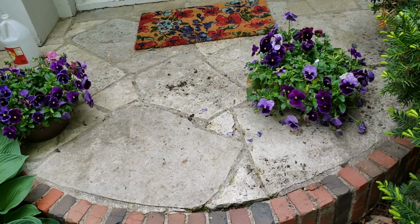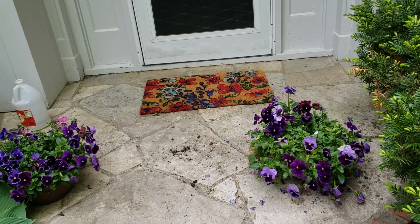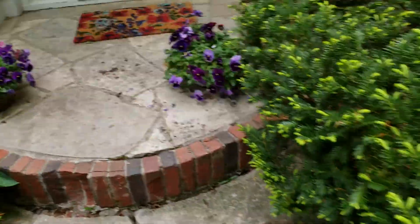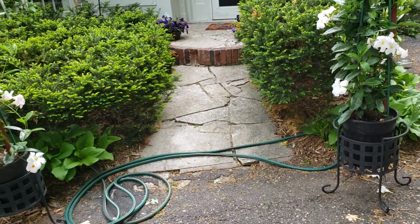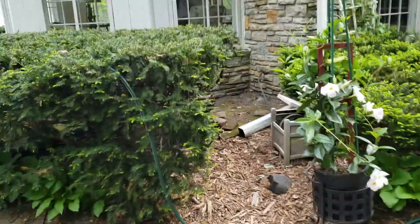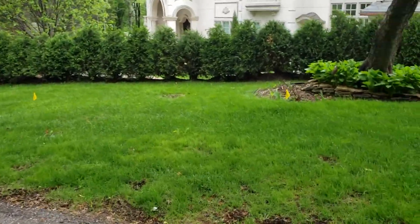We'll call this 8.5 feet wide from left to right, and we're going to call it 7 feet deep. Okay, 8.5 wide, 7 feet deep, arced around here. And then this walkway, like I said, is going to be made out of that limestone with the bluestone ramped up. They want the step from the walkway to the step to be 5.5 inches, the lowest it can be. They have arthritis, they have a hard time getting around. They want it to be as minimal as possible.